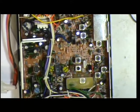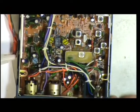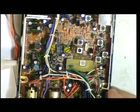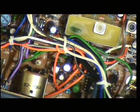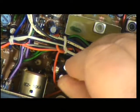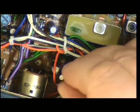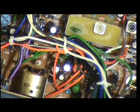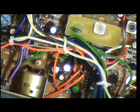We'll pop it onto frequency. CT1 — there's the synthesizer chip just down the front here, and there's a red trimmer capacitor somewhere amongst the jumble of wires. Doesn't matter how many years I do this job, I always make it go the wrong way. There we go — 27205, spot on. I've just pulled it down a little bit.